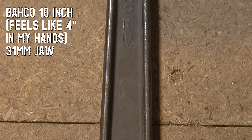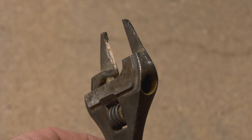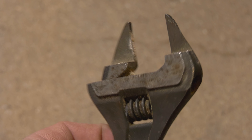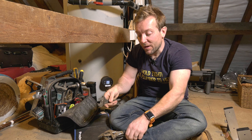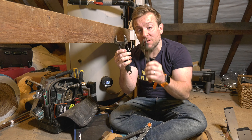Bahcos, for me, are the adjustables that I buy. I always have Bahco adjustables on board. I've also got these Ox ones. I've got these ones because, number one, they're also quite wide for the size that they are, but also they've got a really fine blade on them for the adjustable where it grips itself. So that's quite handy for getting onto nuts that are really, really small. If you're tightening up onto something and you've got other nuts around it that you don't want to round off, that's when these come in really handy. And it's got this handy little push-on thing that you can undo stuff — you can push it onto a nut and that'll undo, and that's what I use it for.